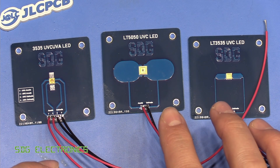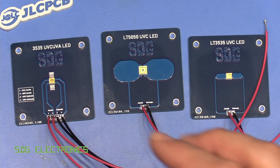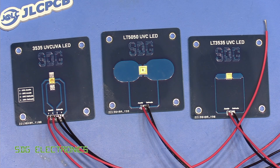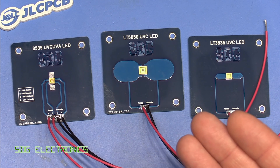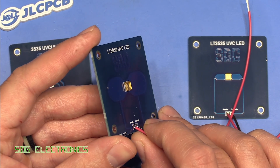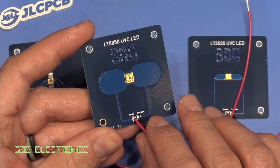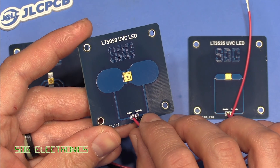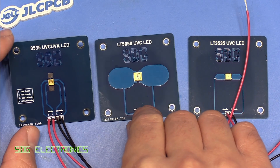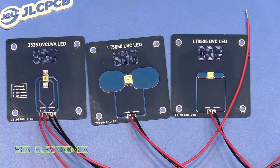What they are probably useful for is things like optical detectors — where you're putting in a fluid that fluoresces only in this region and looking back with a photodetector to see what's happening. I can imagine it being quite useful for instrumentation. For sterilization it only has very limited usefulness, though you could put these in a water column and pass water through it as a means to sterilize water — but it would need quite a lot of contact time with the UV LED to kill everything. At least we found some that appear to be completely legitimate. Hopefully you found the video useful — thanks to all my Patreons keeping the channel going. Until next time, thanks for watching.